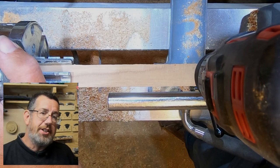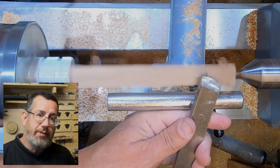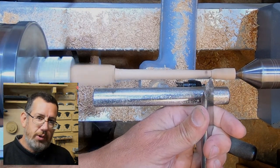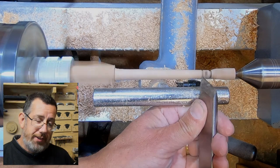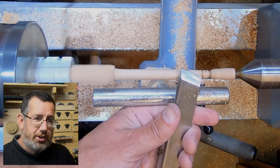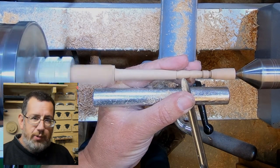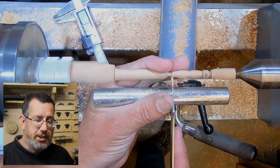Because this is a wizard he's obviously going to need a staff, and before I did the staff I decided I wanted to make an arm for him. I found another nice piece of offcut — another piece of oak with a triangular shape. Because oak will break apart due to the really wide deep grain, it's best to drill your hole first and then turn it down. Using variety tools, skew, and the detail gouge, I shaped the hand and the arm, taking it down to about three and a half or four millimetres on the end for what will be drilled into the body. Same as before — sanded back, sanding sealer, Wood Wax 22.